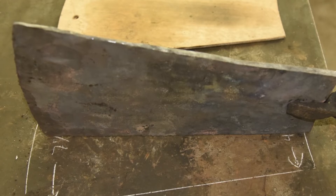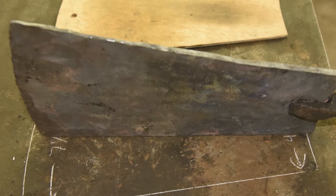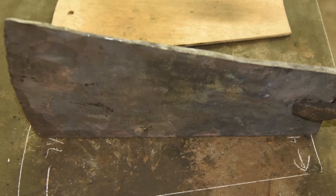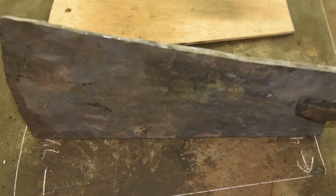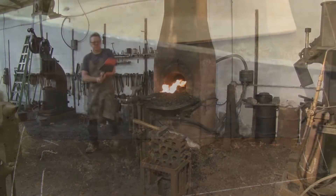So now at the narrow end, we still have a thickness of 3/8 or 5/16, and at the wide end, we've hammered it down to approximately an eighth of an inch. This is nice that it's getting thinner and wider towards the back because that means our surface area is increasing in relation to the volume, so it will shed the heat better.